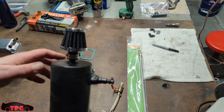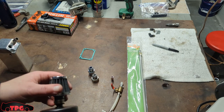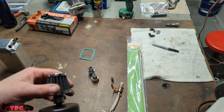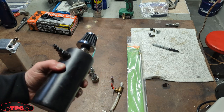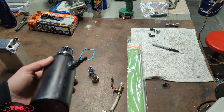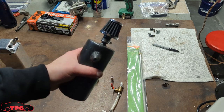Or if you're making big power, you can put a breather on it. But most guys will put dash-16 or something big — AN fittings — have them TIG welded onto their valve cover: one in place of the PCV port on the back of the cylinder head, and the other one for the breather that's right by the thermostat housing, fed into a catch can off to the side. I only had the one line, the vent line, running into this. This was back when I was first starting welding and didn't really know how to do any of it. I still am not that great at it but I'm better than I was. Regardless, for a first attempt, it's not too terrible.